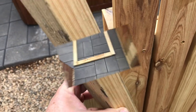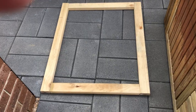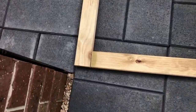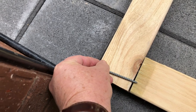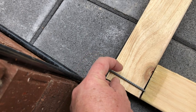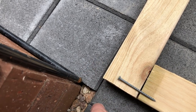We're going to make up a square frame and then put the pickets on. I've got a very precise gap I have to have on this end, so I'm actually going to put this last picket on — the frame doesn't have to be precise and exact, it can be in a little bit as long as the last picket gets its correct gap. You want to lay it out somewhere square so that it ends up square both ways, and I can actually lay it out square with the line here as well. The screws here are very big long screws but they're not long enough to go through the board, so what I'm going to do is drill a much larger hole in to about this depth — big enough for the screwdriver head to go into — so that we can drive that right through. I'd have to come about a third of the way in and that'll give a really good connection.